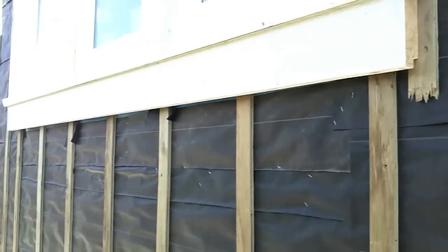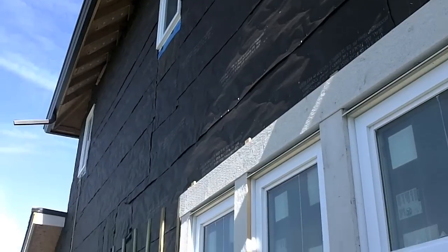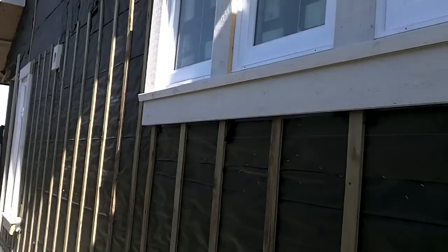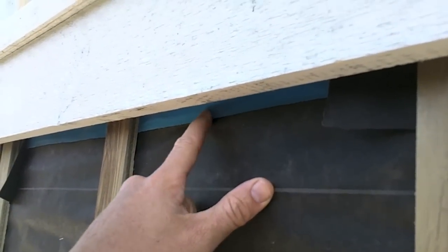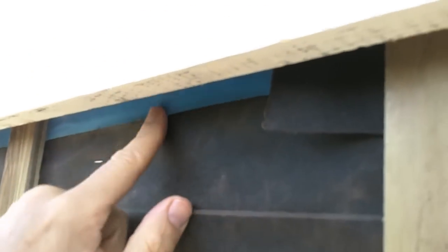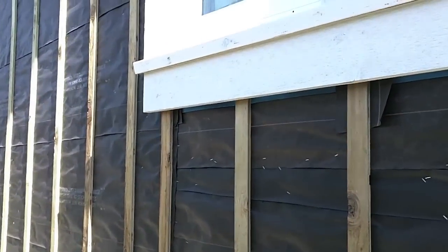We've used a few different materials, like a Tyvek type material, but we found in speaking with our siding guys that the most successful way to clad a house is with 2 layers of 30-minute building paper overlapped. The next thing that we do, and we showed you this before, is wherever there's a window that goes in, we use this peel and stick material and we overlap that. It's kind of a tar, plasticky material, and we use a primer, so the peel and stick membrane is stuck hard to that building paper. Wherever there's a perforation, we put that in. That includes hose bibs, everything like that.